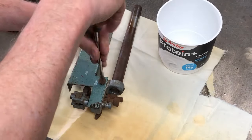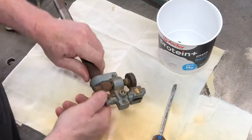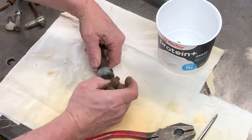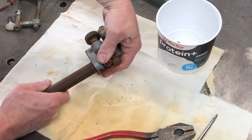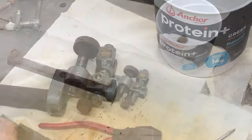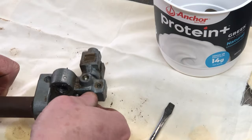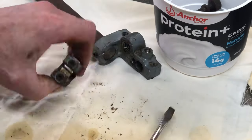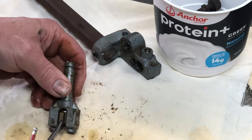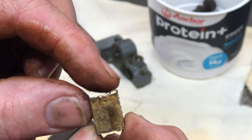Now the top guide is disassembled. This was a little bit tricky - I couldn't get this right out and had to do a bit of thinking. Finally you have to remove that piece, and then I had to cut a slot in here as that thread was a little bit tight. Once I got the slot put in I was able to unscrew it, and then I was able to get the other piece out by turning it. Again the blocks come out and the same thing here - they're not flat, so the blade has been rubbing on these guides.